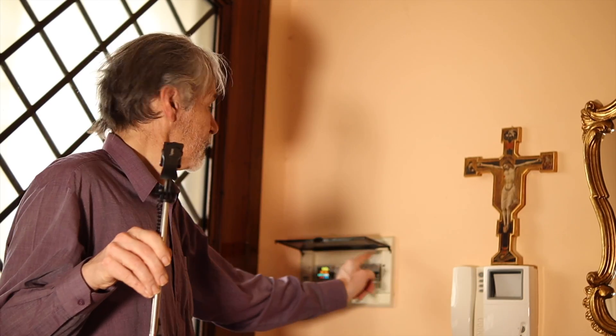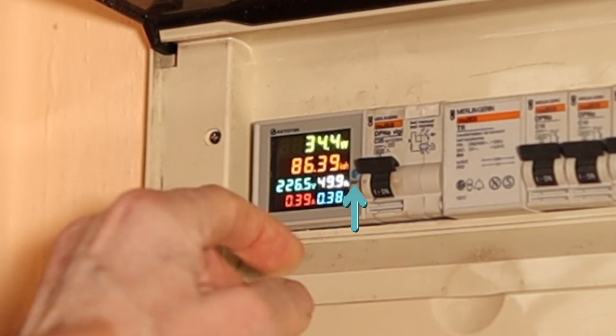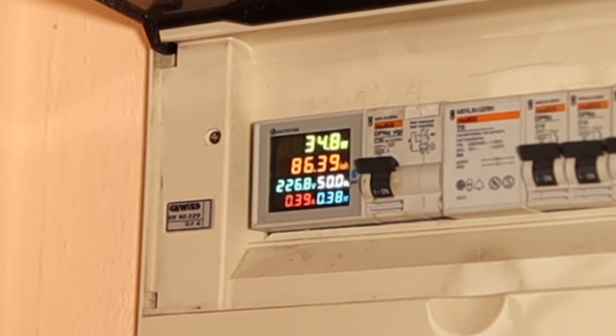An electrician is really helpful here — you can do it yourself but have an electrician check it afterwards. Installing the meter is straightforward on the switch panel. Our physical meter is outside, so I'm very happy with this convenient meter that shows many different parameters all in one screen — and as I said, you can close it and still see the display. A smart way to use it during a blackout: at the start of a blackout, push the reset button on the side of the meter and the energy reading in kilowatt-hours will go to zero. Then you can watch it and stop when it reaches our limit of 2.5 kilowatt-hours, to keep the battery in good health.